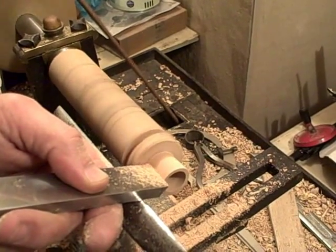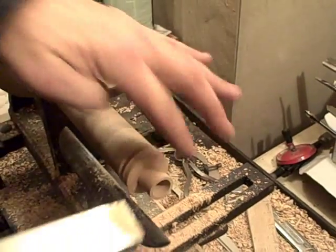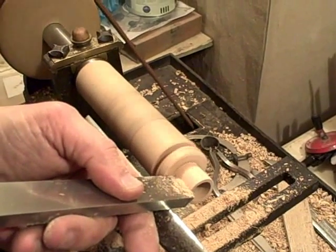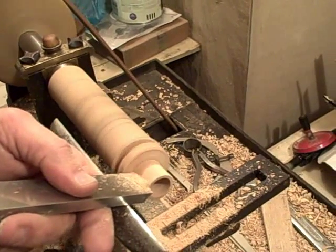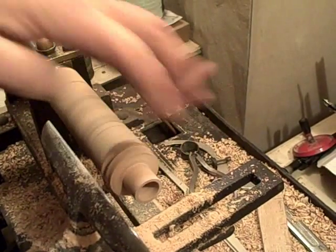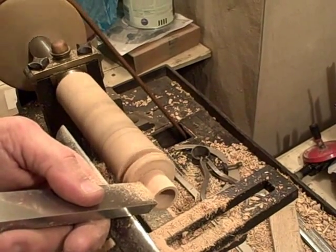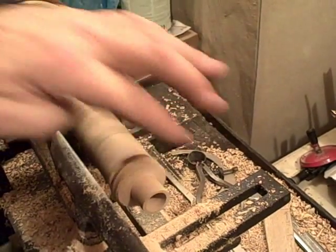When you start to get those nice fine little cuts off there, you know that you're getting almost a sanding-type touch on it. Now those calipers that I showed you before — they were set to 22, well actually to 23. I believe the measurements I was going down to was about 21 or so, I can't remember now. But anyway, it's a good millimetre more than I actually need it to be, so that any sort of fine cuts I'm going to take are not going to send me beyond where I need it to be.